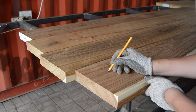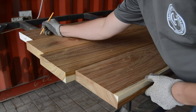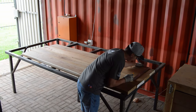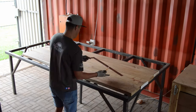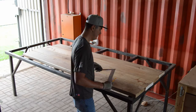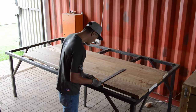I'm marking my wood one to four — this is quite a handy tip, especially when you're working with more than one piece of timber, so once you're going to work with your wood, flipping them around or turning them around, when you do your glue-up you can place everything back the way they were. Now I'm doing the markings for my joints where I'm going to cut with my biscuit joiner, and I'm going to leave a rough spacing of between 400 to 500 millimeters in between each biscuit joint.